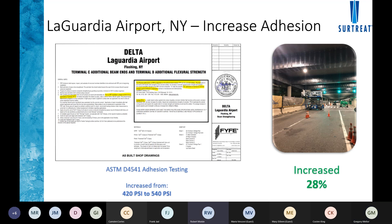It's worth noting that the FRP primer is a two-part system. One part improves strength, and the other is the migratory corrosion inhibitor used on reinforced concrete — a product with a tremendous track record of performance. Treating the whole beam avoids the problem entirely. Beyond increasing tensile strength, the primer also improves compressive strength and resists water penetration, covering a broad range of potential problems.